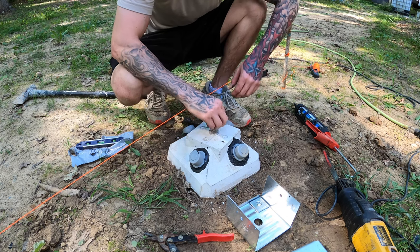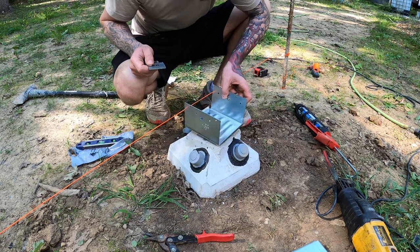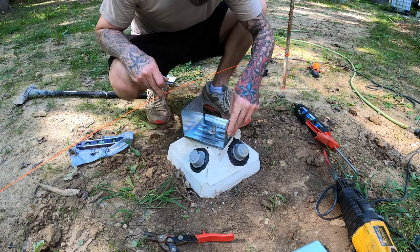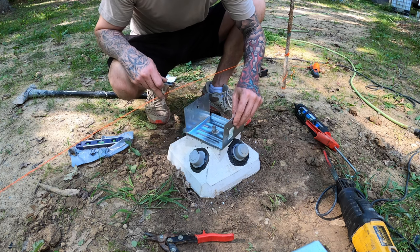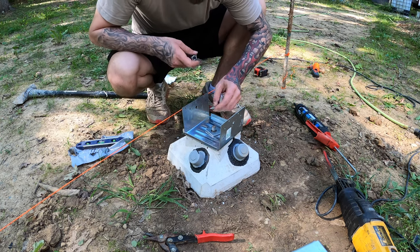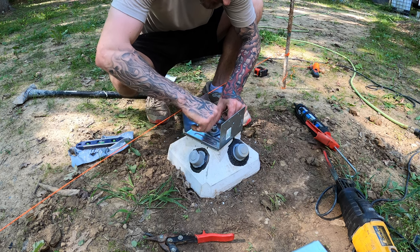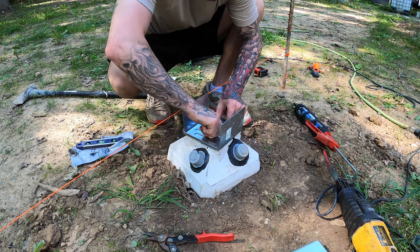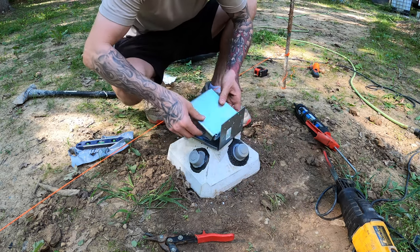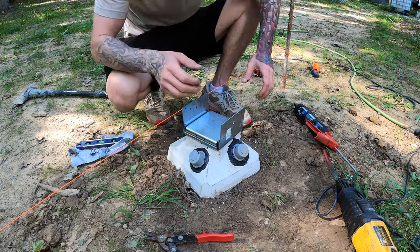And then the way these things work that we're using, Diamond Pier gives you the washer and the nut. You go ahead and sit your plate on, and it's nice that you have adjustability in every direction since it's oversized. So whichever way we put this, for example, it can go right there. We can use the washer that the thing came with and the washer the Diamond Pier came with. Then you simply bolt that down, put your cap on, and now you're ready for a 6x6.